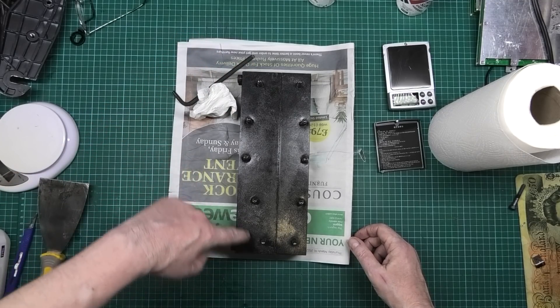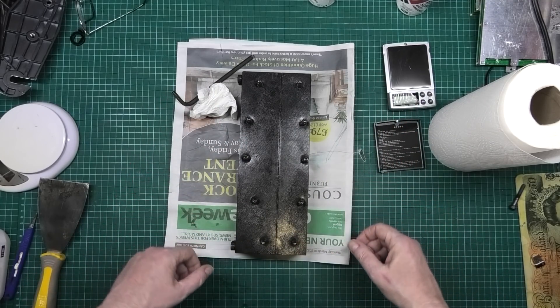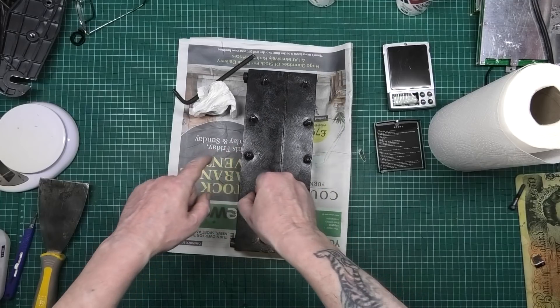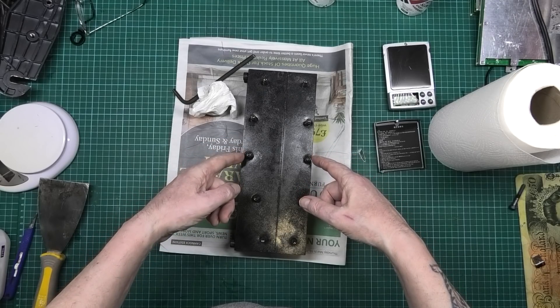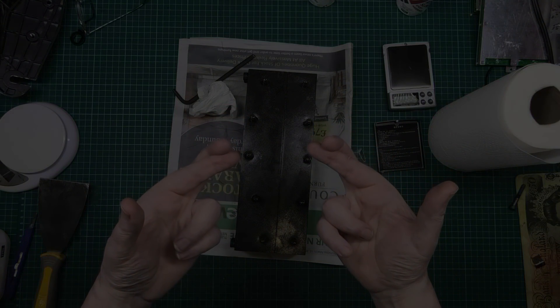I've learned from my mistakes with 3D printing these molds - you can cut pieces off or form them where material isn't needed, rather than making a complete full-size square mold. The bottom piece is threaded. People say you can't thread into plastic, but this is PETG at 40% infill and I've threaded into it perfectly. I've got to leave it 24 hours now before I can release it - I'll see you next time.